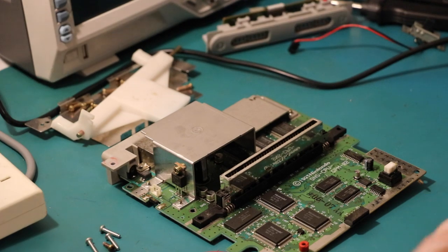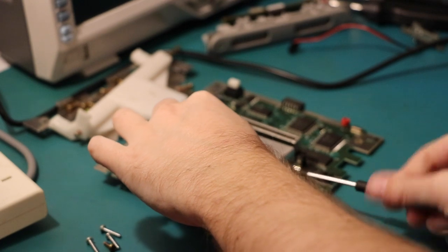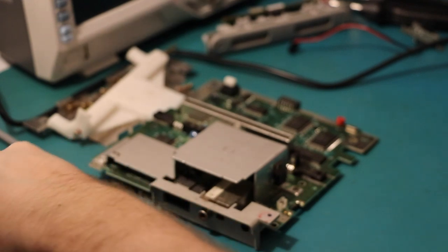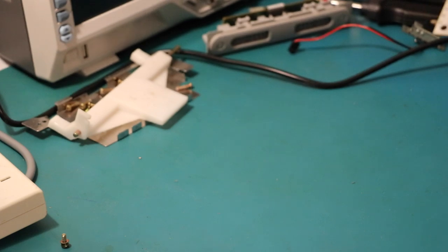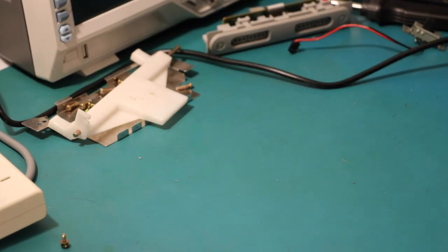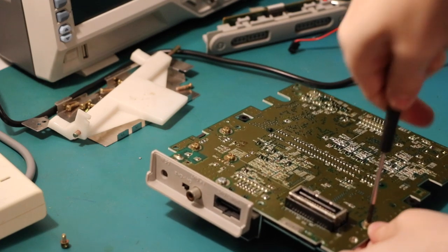To get to that metal shielding, we need to firstly unscrew the voltage regulator, secured to its giant heatsink. Put your other screws a little bit separate so you don't get them mixed up. And you also need to have some thermal paste if you've got it. One, two, three. What's that fourth one do? RF connection to the RF. Okay, that's fine. I'm not even mad.